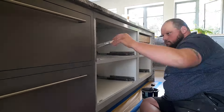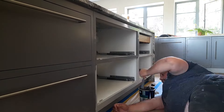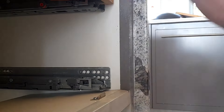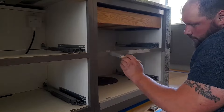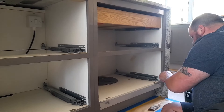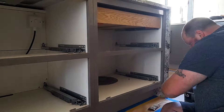On those drawers we had already painted the frames previously, which is why I was able to paint them there. When it comes to painting the frames, you have to remove the drawers — you can see footage later showing how I removed them. You got to get rid of the drawers so you can paint the frames. It's a bit awkward — you can see me lying on my back. I don't need tape everywhere as long as I can cut in and keep a straight line. Once you've applied two coats on the frames, you can put the drawers back on and paint them, or put them on a pair of sawhorses. Organizing what to do when gets easier the more kitchens you do — I was doing a couple of drawers per day while doing the doors, mixing and matching that way.